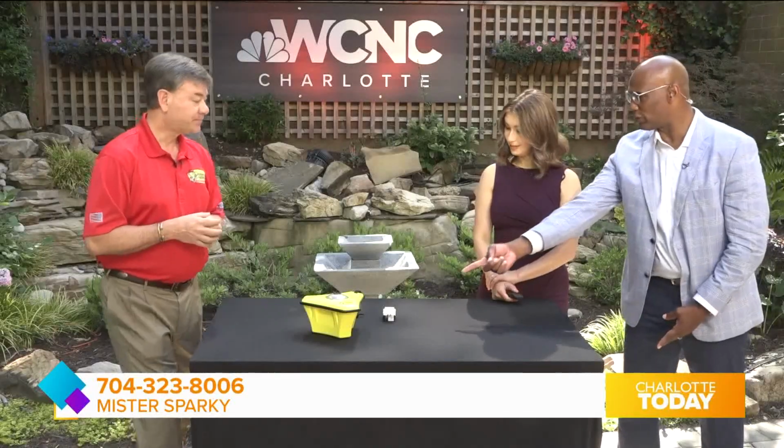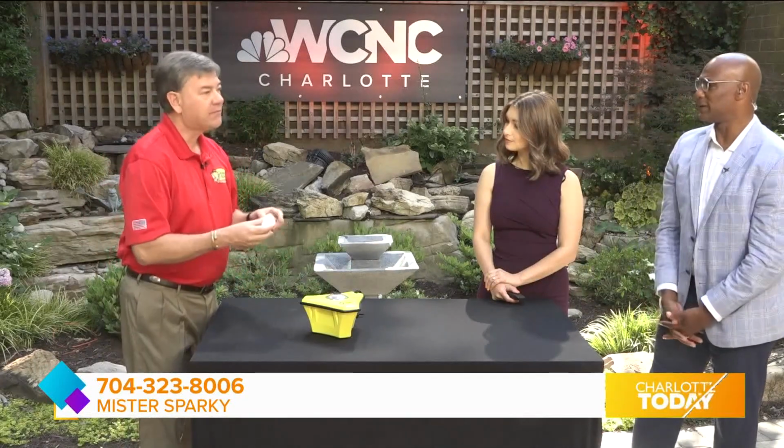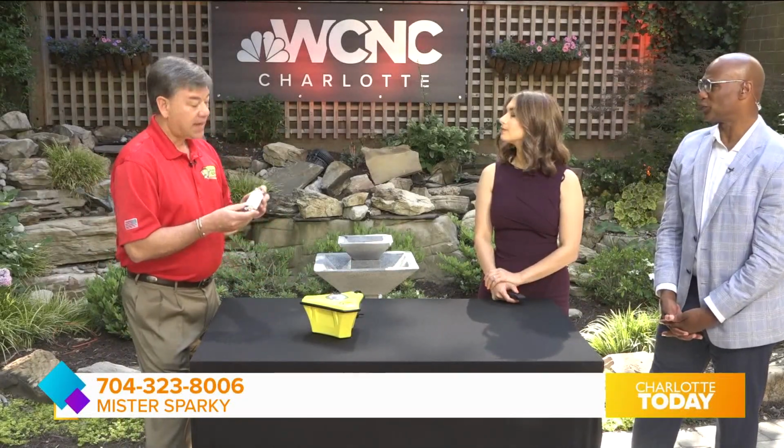Well, you have this device right here. What does that do for us? This is a ground fault receptacle, and this can save your life. This trips at 5 milliamps. 10 milliamps will stop your heart. These are required around all marinas, docks, and pools. You never run a circuit without it being on a GFCI receptacle or a breaker. This will save your life. And it's becoming more and more prevalent. Just 10 years ago, it wasn't even written in the code as far as these ESDs, but now it is.